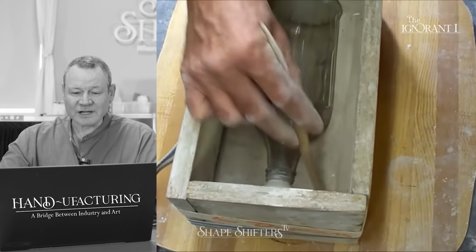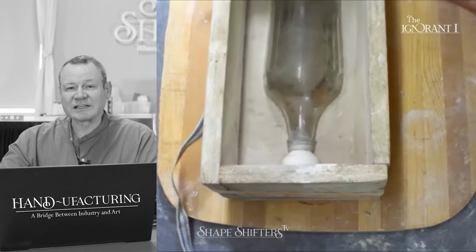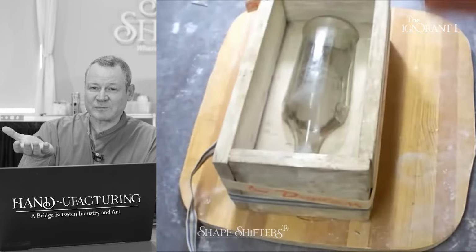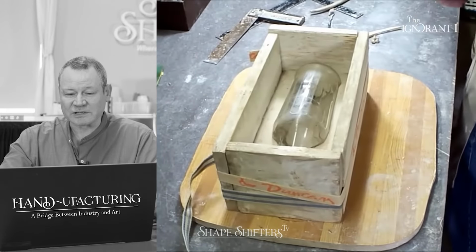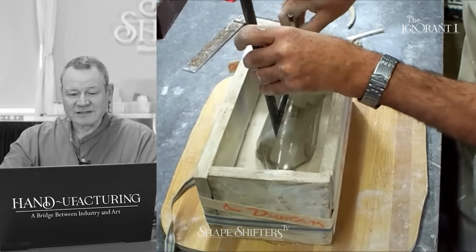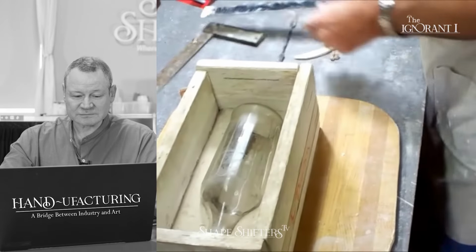He's going to shave all that away anyways, meaning he's imprinted the clay. And if you think about anything in clay here, the negative is going to be the positive in plaster. So any indentations, he's going to be able to flip over in plaster and shave them off. So he can move pretty quickly here. Put your pouring indication line. It should be the equal thickness that he had for the sidewalls.